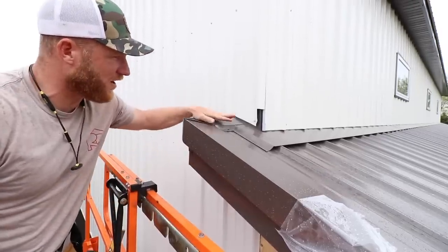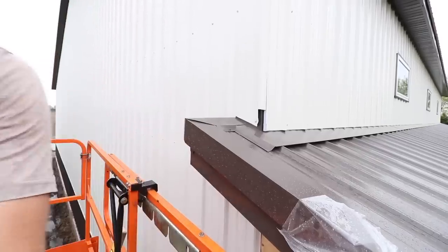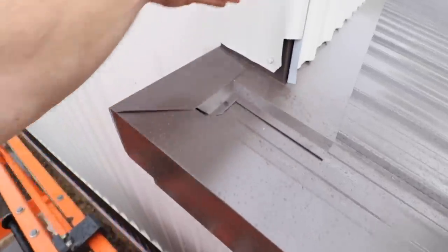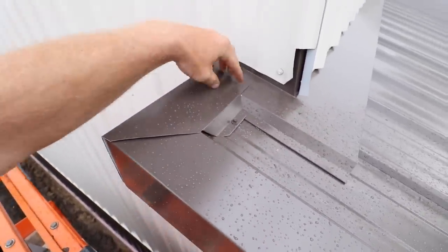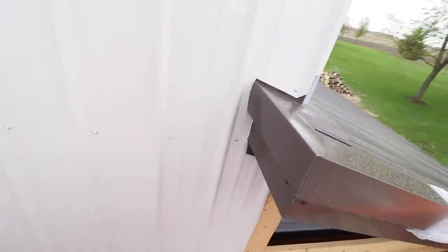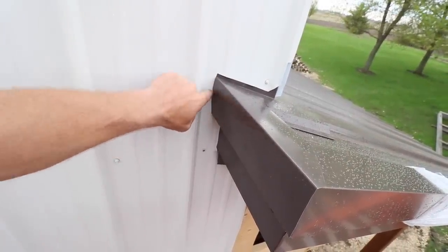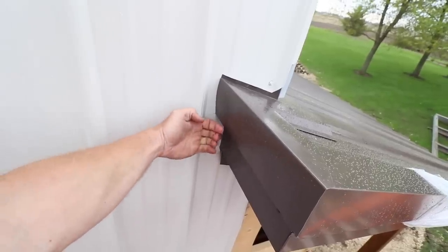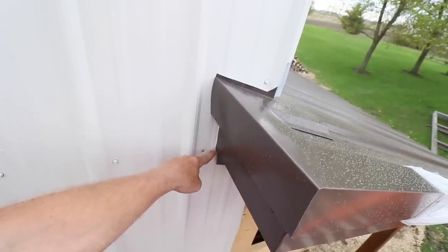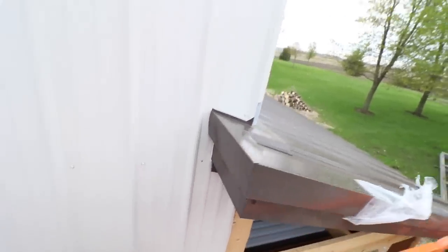This is not completely done, but it's almost done. I've got to get off this section because the rain's coming down and I don't want my camera to get wet, but I'll show you what we've got. I'll end up putting a fastener here and here. All the water is going to come down and come off. This runs all the way under, so nothing to worry about here. This one runs all the way up, so nothing to worry about coming around the back. This is flashed up under, so any water that comes here is going to make its way out, hit these minor ribs, and come out. The steel is folded back around, so this little point right here is the worst spot, but I've got a trim flashing under there, so this little guy is just cut out to keep the water deflected.